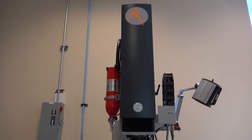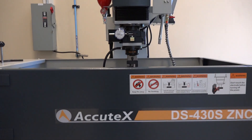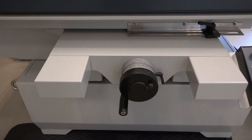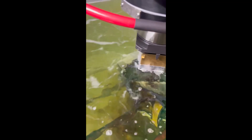This machine is equipped with an orbiting head. When you're running a die sinker, your tool — the electrode — could be almost any shape you could imagine. It could be a mold for a phone, a toaster, a car part, anything out of plastic or even metal die cast parts. Sinkers are used very frequently for those things.